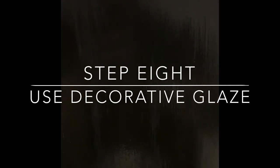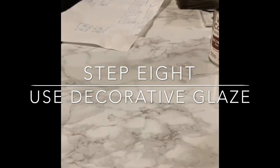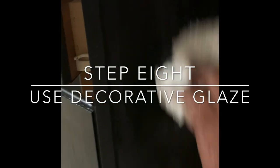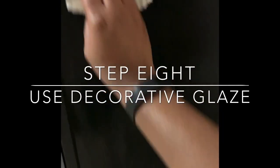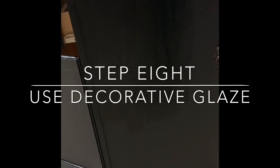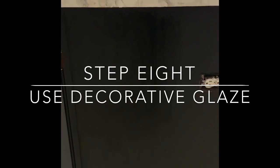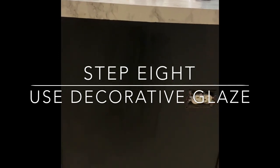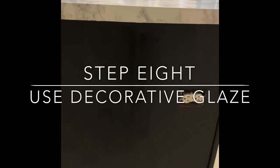Once you get done painting, you're going to use this glaze cloth, or it could be called cheesecloth, and you're just going to wipe it off. And it gives you that glossy type look, if you could tell in the picture from what I have painted so far. But I'm gonna go ahead and paint the whole cabinets and let you guys see the finished touch of that. And then after that dries for 8 hours, I will go ahead and do the protective coat.